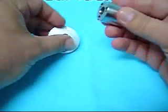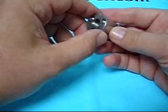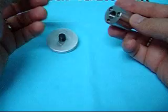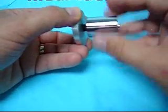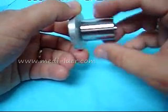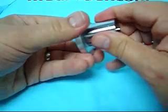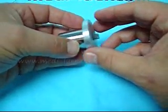If you have a reference fitting that does not have the 1-8 inch NPT female thread, a trip to the hardware store can get you an adapter — assuming the fitting has a 1-8 inch male pipe thread, you can get a male-to-female adapter and screw that into the bottom. Some other countries might have an M10 thread on the bottom, in which case you'll need an adapter there as well. But once you get it on, just screw it on nice and tightly — hand tight will get the job done. This is then ready to mount up on the machine itself.